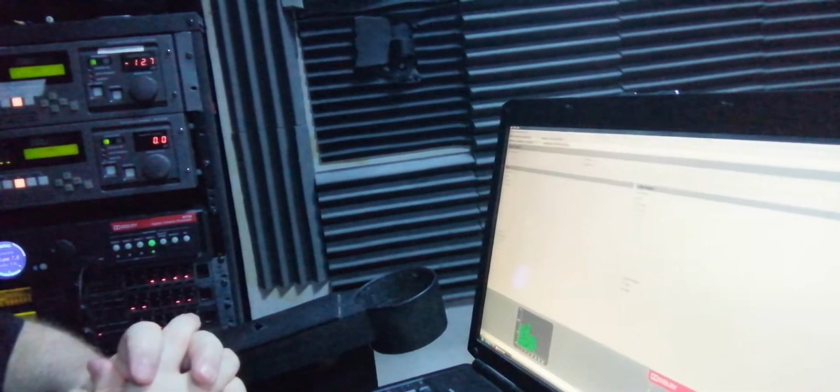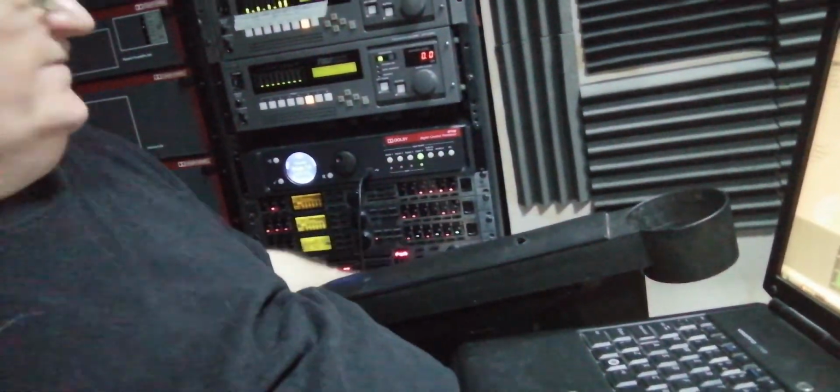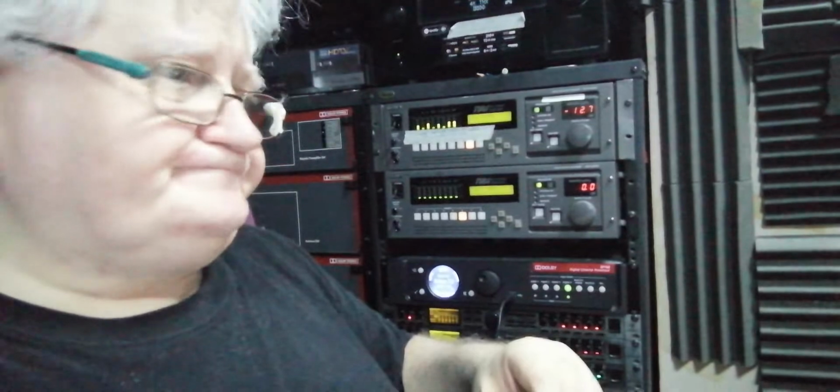So it's very cool. Just the EQ levels back to their normal position, because I might use the equalizer, just to see. But any EQ that's done is mostly done down on the DCX to get the speakers' frequency response pretty close, and that's with microphones placed close near to the projection screen.